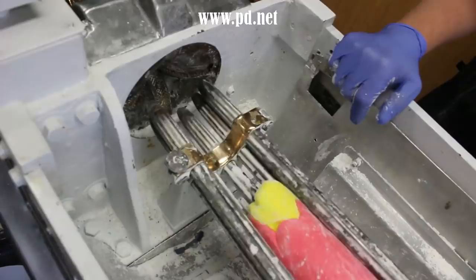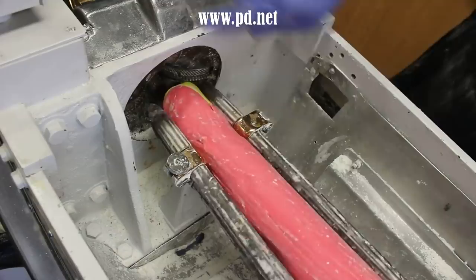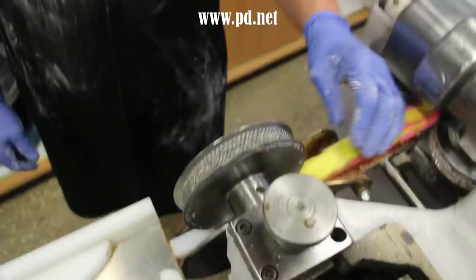This batch roller is a little unusual — it has four mechanical rollers called sizers that size the candy down. It's a first step in a series of sizing processes to get the rope of candy to the right diameter. He then takes the candy and puts it through a second set of sizers to make it even smaller, then reaches around and turns on the cut and wrap machine.